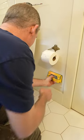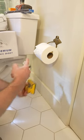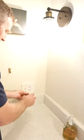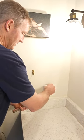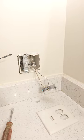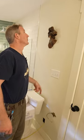We basically have a stud right here, and we don't have a stud all the way until we're behind the toilet, so anywhere in here we're going to be capable of running a wire through. What I normally do is cut a little hole in the top of the box and run a fish stick up through here. The game plan is to drill through the top header and then fish the wire down into our hole here.